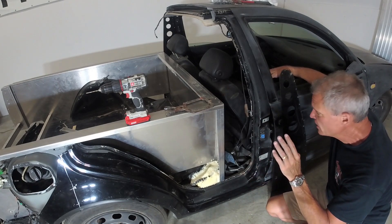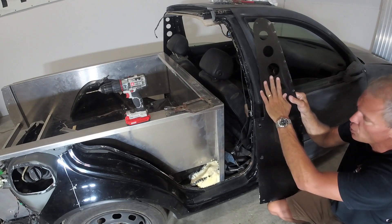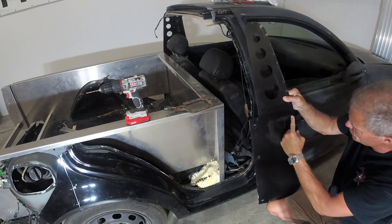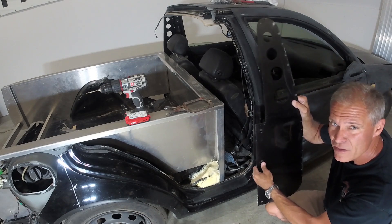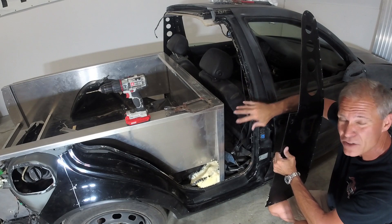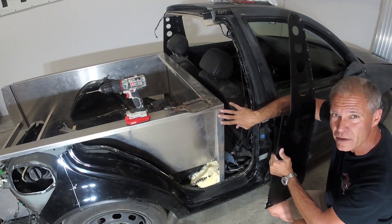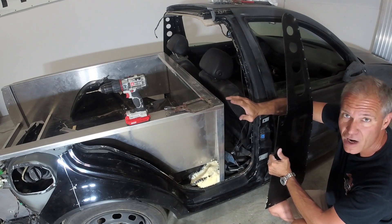This does apply to the Mark V as well. We're going to take the B-pillar brace — this is a painted one — and you recognize it by some of the holes in the pierces and rivet holes around the outside edge. This is a big part of the car. This is the brace that reinforces the whole B-pillar area and transfers the load to the bed so that the car remains a very strong unibody-based car.